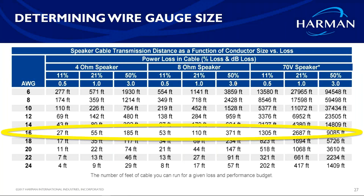How often are you doing a 1,300-foot run? When you're in the 100–300-foot range, you and I won't be able to hear the difference — it will still sound good. Tap your speakers appropriately: on a 70-volt system, the amp will clip when it reaches 70 volts. If you want an average output of 5 watts per speaker, you may need to tap your speakers around 30 watts to achieve that average. You can see why 16-gauge is very popular for both 8-ohm short runs and 70-volt runs over 1,000 feet.